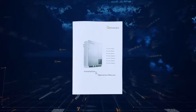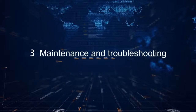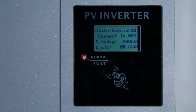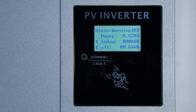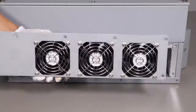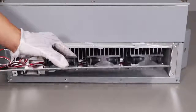For other knock operations, please refer to the manual. A warning is a general running alarm that would not affect the inverter's power production. The warning message on the LCD display is only a reminder to pay attention. The most common warning message is a fan fault; as a wear-and-tear part, fan cleaning and replacing may be required after long-time operation.